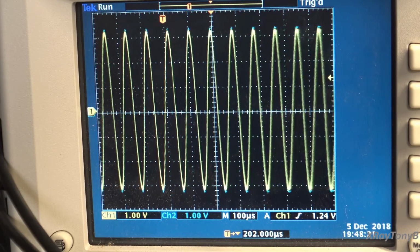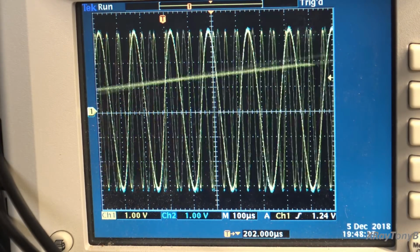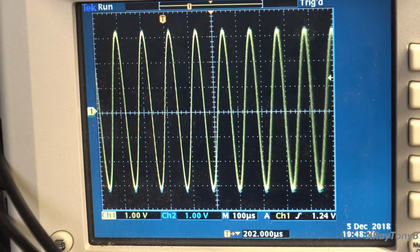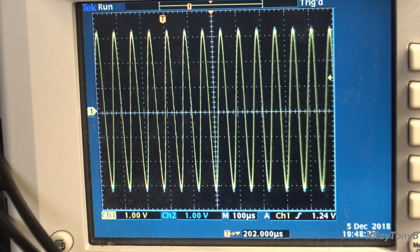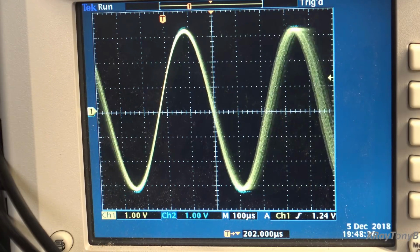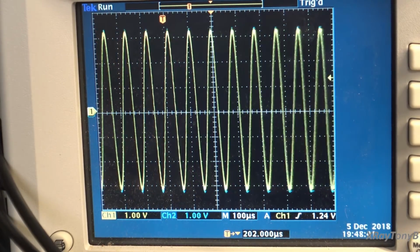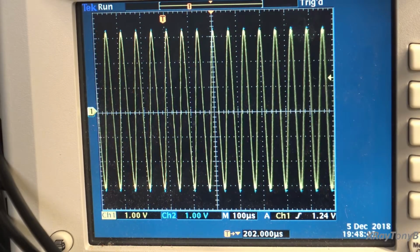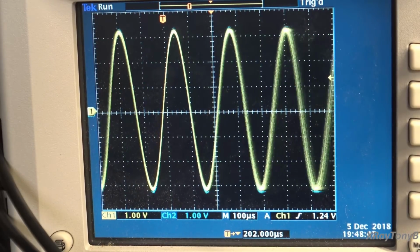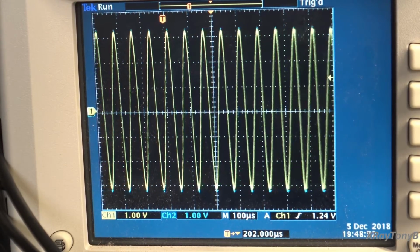No distortion. So that's actually a good thing too. And I'm driving this amp just medium. I'm driving about 60 or 70 watts into the dummy load. So I'm not driving it real hard, but that would be a very loud listening level in a normal room. And you can see it's performing very well. The heat sinks are just getting barely warm. So this is all very good so far.